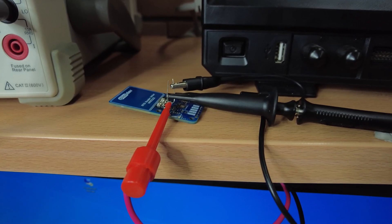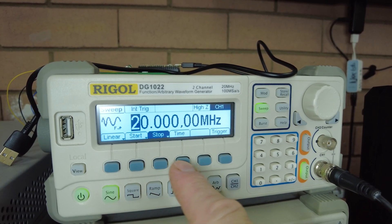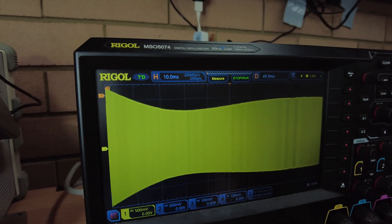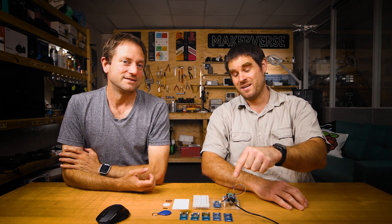Then we started doing our measurements and found that the inductance was fine, but the resistance was just too high. We made a matching circuit for it and the bandwidth was massive. We had this thing operating at 13.56 megahertz and the bandwidth on our matching circuit was like 5 megahertz or something — we could barely see any energy being absorbed at all. The Q was just way too low. The problem with the large bandwidth is that there's less energy to actually be captured by the receiving coil — lots of energy going into heating up the coil, not very much energy actually turning the tag on. So we didn't get very far with that one.